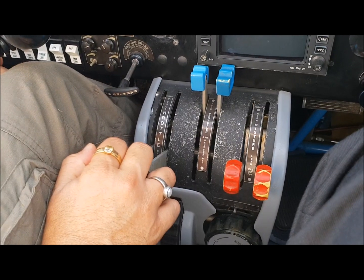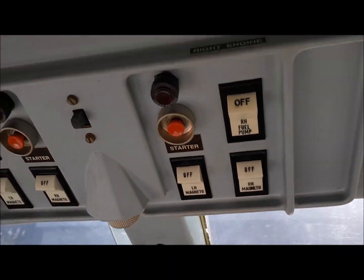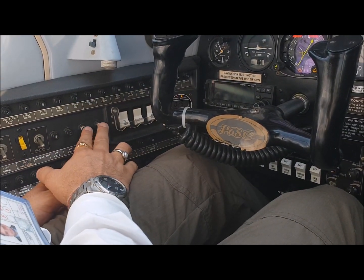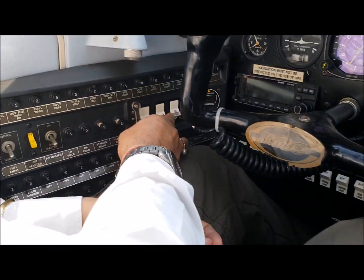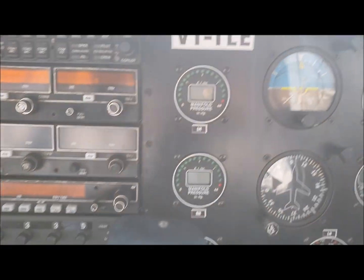After everything has gone off and everything is silent, we put our strobe lights off and magnetos off. Secure the fuel on both engines to the shut-off position. Pull these two CBs — this is very important: the flap actuator and the starter relay CBs are pulled off, so that if someone accidentally presses the starter, the aircraft wouldn't start. Put the gang switch off, confirm fuel is accounted for, and that is how we shut off this aircraft. Thanks for watching — we will put some more videos on this. Thank you very much.